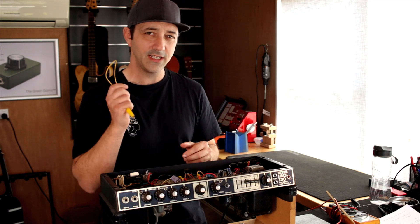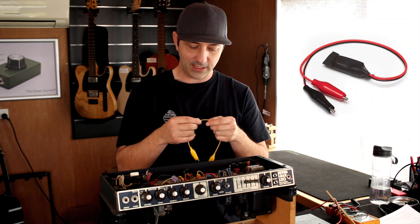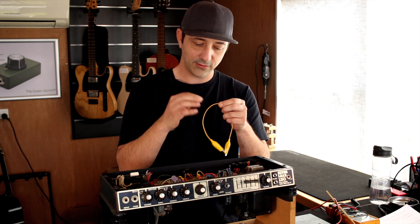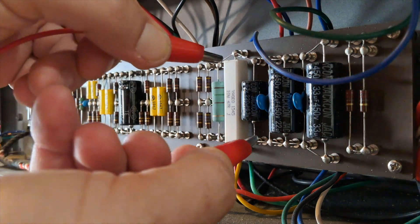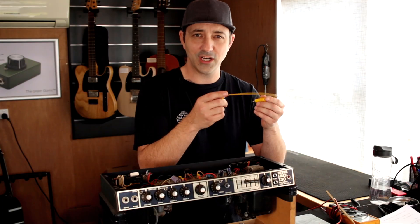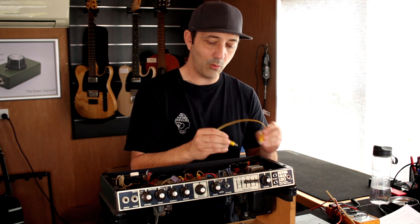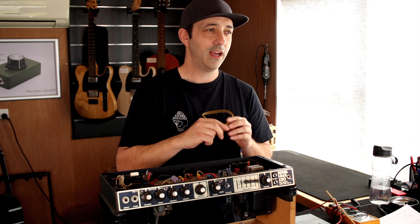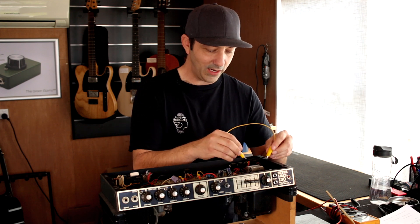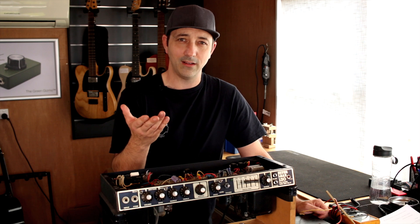There's another type of discharge tool I see used — it's just an alligator clip snipped in half with a resistor soldered in the center and insulated. You clip one side to one side of the capacitor and the other side to the other, and that discharges it. My big problem with this: firstly, you do not want your fingers that close to a deadly voltage-filled capacitor — that's just asking for death. And secondly, it's so easy to accidentally leave it on and then start up your amp and kill it. You've not only killed yourself but killed your amp as well.